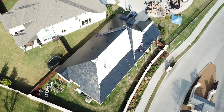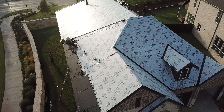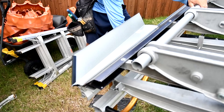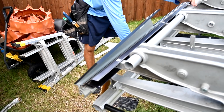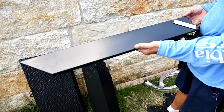You're actually going to find out what your electrical needs are at your initial consultation when they give you a call. Once the glass tiles are all in place, the producing tiles are going to be connected. They'll move on to the final details of the roof such as the trim, the gutters, the ridges, and the valleys. These last details all require metal fabrication and it's going to give the product a nice sleek finish.